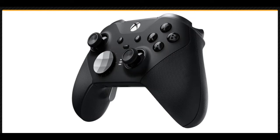The Microsoft Xbox Elite hand controller is more ergonomic and has several features that are not available with the VideoRay IP65 hand controller. The D-pad is dedicated to activating the jog controls. When dynamic positioning is on, this makes it easy to move the vehicle in precise increments while still maintaining your hands on the controller to activate the camera, manipulator or other controls including sonar range and vehicle pitch and roll.